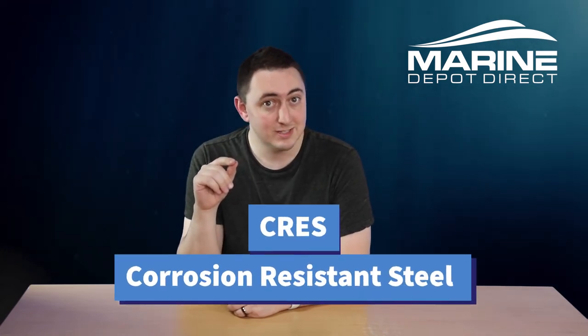The term 'stainless steel' is actually not the best description. The US military came up with a better, more fitting term: CRES, or Corrosion Resistant Steel, because obviously it does corrode, but it resists corrosion at a higher likelihood than other metals and types of steel. Myth 3: stainless steel is hard to clean. It's used widely in medical applications precisely because it can be cleaned very easily. A good polish and regular cleaning can really extend the life of the stainless and even bring it back when it looks rough.